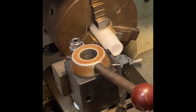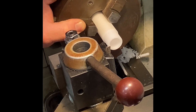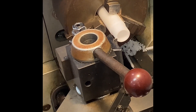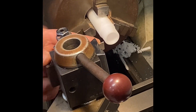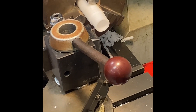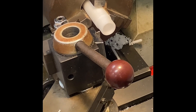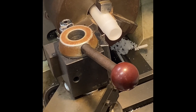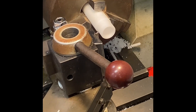I'm going to get close and feel this out as I go. I'm kind of touching off the face but I don't want to cut anything — I'll make a mark so I can see exactly where that's at. The left edge of the part-off tool was touching the face of the part, so now I can move the 350 thousandths I need to. Let's go ahead — there's 100 thousandths, 200, 300, 350 thousandths. You can see where I am at — 350 thousandths.